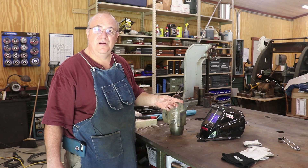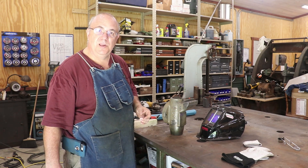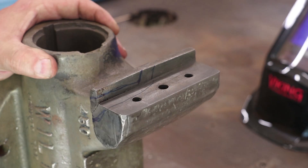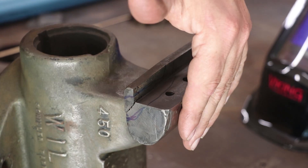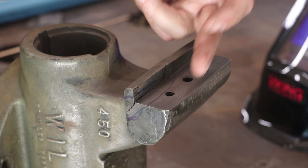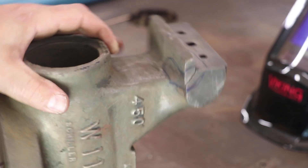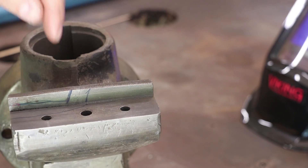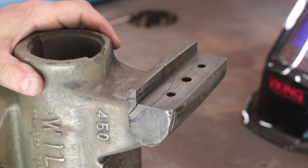It has to do with a little crack up here, and we're going to get that thing brazed up. Andy picked this vise up and it looks like the jaw was a little bit loose. It wasn't real tight, and someone went to pounding on the top of it with a hammer. When they did, it transferred the shock down to this little lip on the bottom and we've got a crack. It's not broken completely off, but it's broken pretty well down in here. You can kind of see on the bottom it goes to about right back in here, and even on the top it's partially cracked right in there. So the game plan here is this is going to be a brazing job.